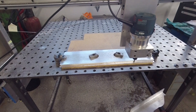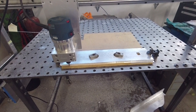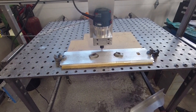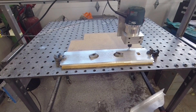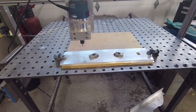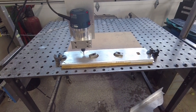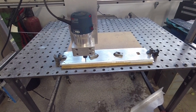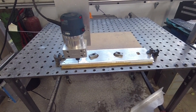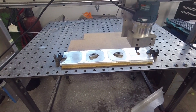It's supposed to be full depth. You can really see here that either my gantry isn't true with the table, or the table has variations in it — it's not as flat as I was hoping. Partly potentially my fault. Then a 2D adaptive with avoidance areas around the two clamps on the ends. At the point where it comes back in you can see some height difference in Z. Thankfully I had a stock to leave on this operation — there was actually an axial stock to leave. Over here it's just cutting air.